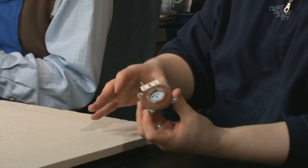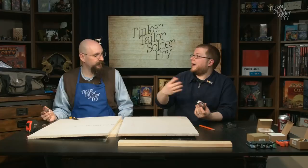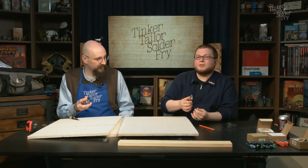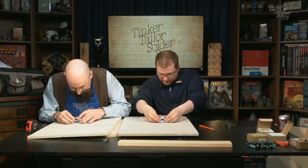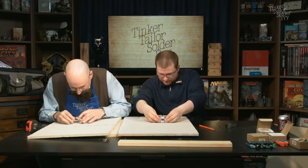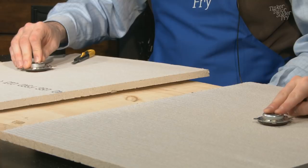When working with these, make sure there's no active cloud of dust nearby, and keep them away from dusty spots. There's a small hole inside the exciter and you don't want dust getting in — especially because it contains a magnet. No metal filings, and don't drill any metal nearby while working on these. Center the exciter on your mark and hold it in place for about 30 seconds to let the adhesive grab hold.